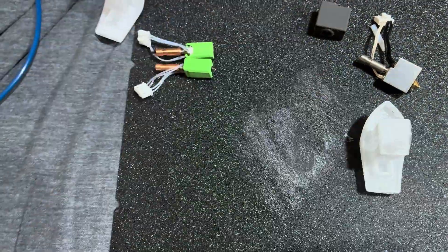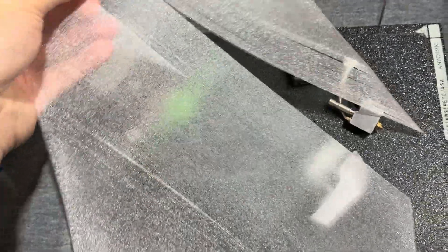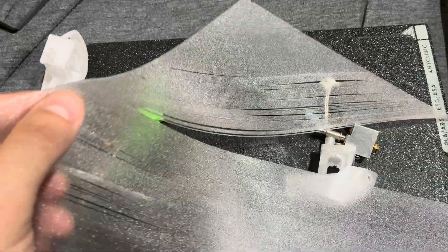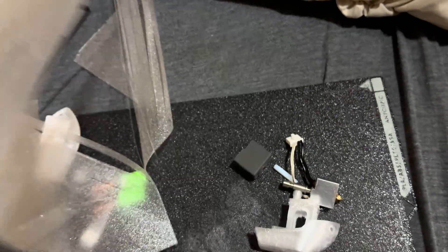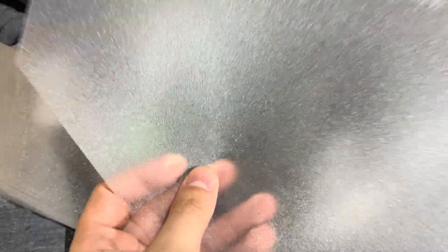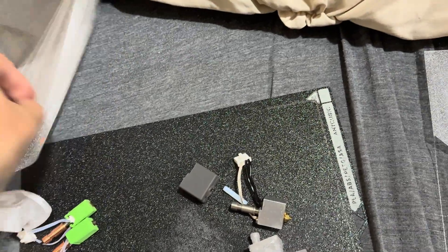Let me show another example. This is a full sheet of polycarbonate at 0.2mm layer height, and it's indicative of the problem I've had with these bi-metal hotends — it's very difficult to get a good first layer. Part of it is temperature, but part of it is the nozzle design in these upgraded V2 versions. However, with the stock nozzle, the result is just clean through and through. It's perfect — really good top surfaces and really good first layers. I love this nozzle.